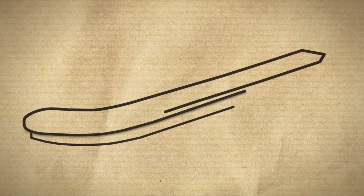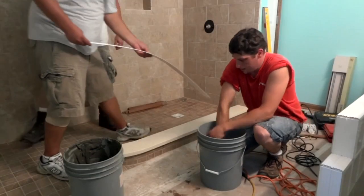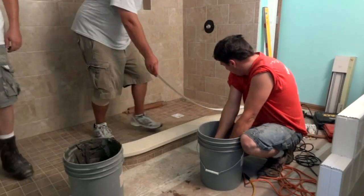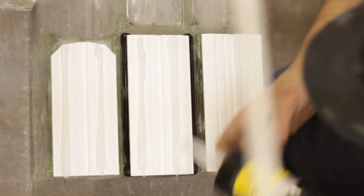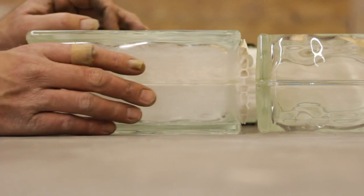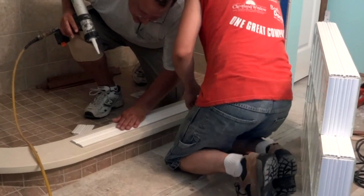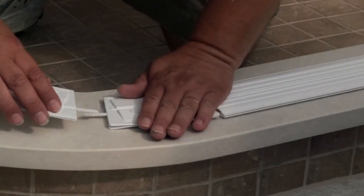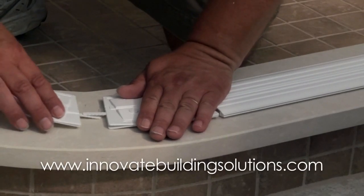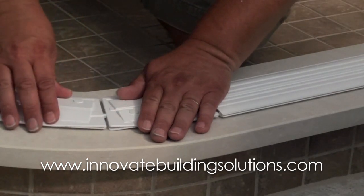Using a pencil, you should pre-mark precisely where the wall sections will sit on the curb cap of the shower base to give yourself a visual guide. The first thing to be attached to the curb cap is a layer of vinyl stack material — the same stacking material used between the individual glass blocks when the sections are pre-made. The bottom section of the wall will stack on this material. The vinyl stack system uses what's called an arc spacer to allow you to conform the layout of the vinyl stack pieces to the curvature of the wall section.